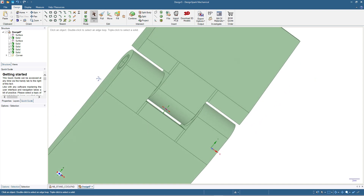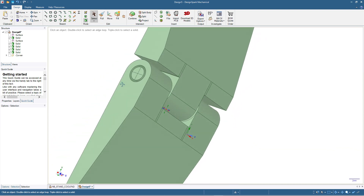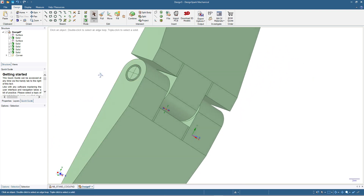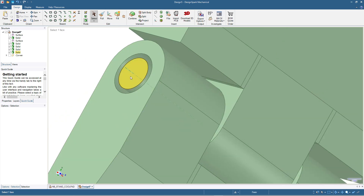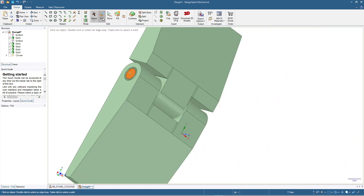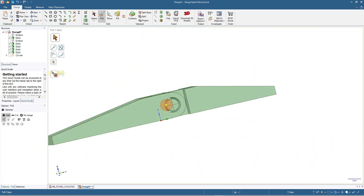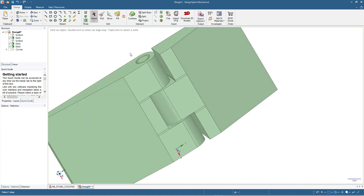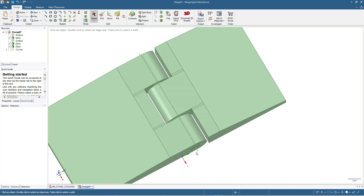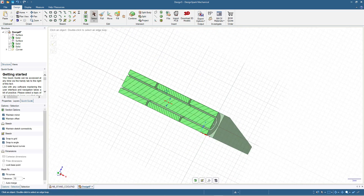Next we connect the center knuckle to the right leaf. We can't do it directly with the same surface because the width is different — if we force it, it will touch the outer knuckle and won't move after printing. So we use the project tool, press Enter to get the projection on the right leaf, then click pull and 'up to' and click the circle. Now we pull or extrude the pins — clicking the outer surface of the pin, pressing F to simplify, then pull with 'add' and 'up to' to connect it through. The pin is now connected from left to right.